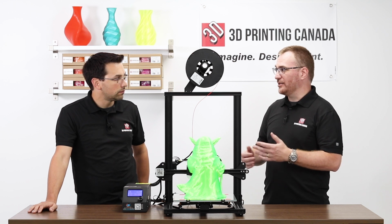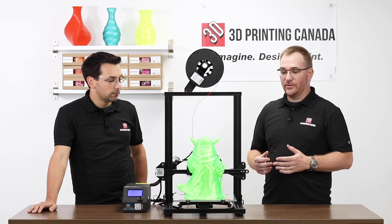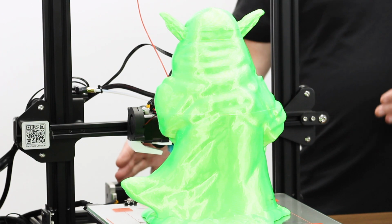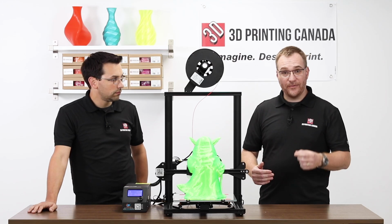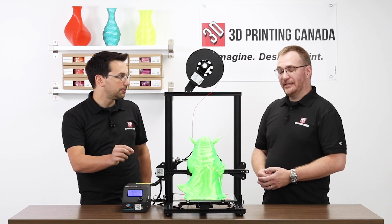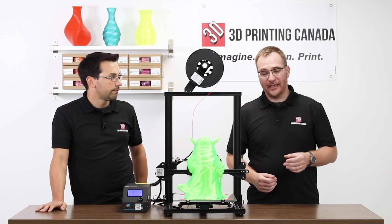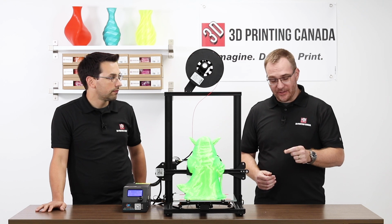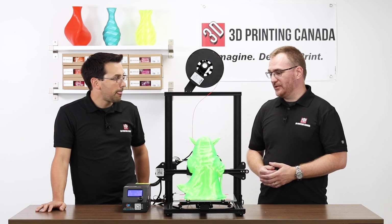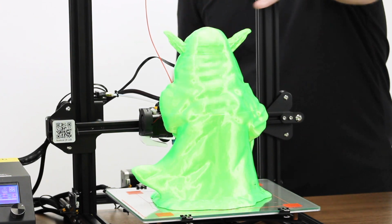There's some calculation you can make based on which driver you are using. You have to calculate based on the power of the stepper motor and your driver. You have to calculate the right reference voltage on your driver. Your driver probably had that standard potentiometer adjustment for the voltage? Exactly. It was a TMC2208. And with a multimeter, I had to adjust the reference voltage on my driver. So I did the right calculation, fixed it, and now I've reprinted this one, but without layer shift this time.